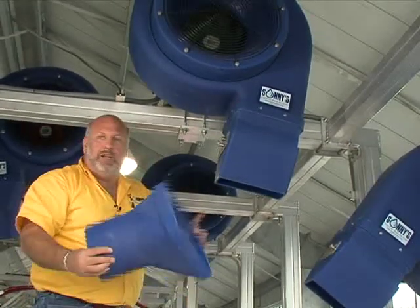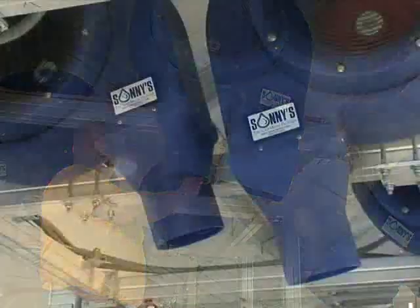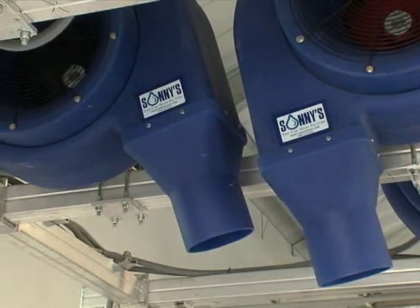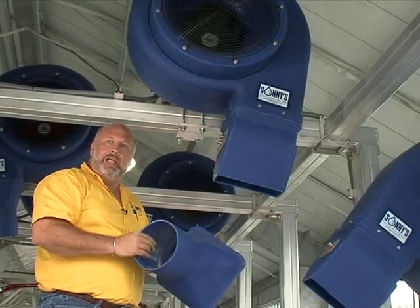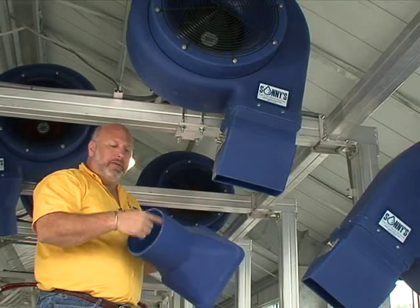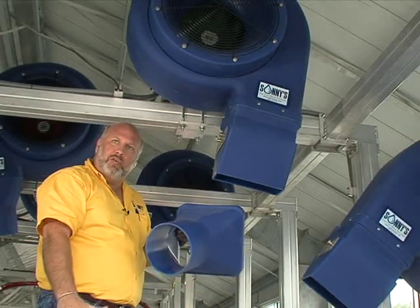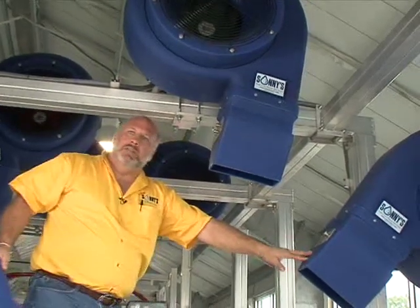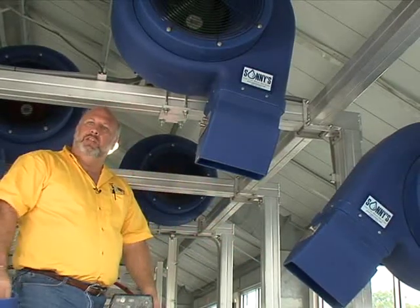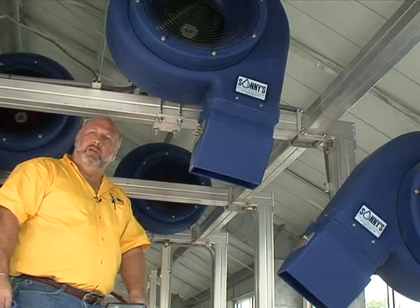If we need a little more pressure or go a little faster, we can convert to our round nozzle, set at 12 degrees — good for stripping at slow speeds but still with the velocity to hit the car properly at high speeds. Like a tube nozzle, the round nozzle keeps airflow straighter and tighter, giving more impact when the vehicle is further away. We normally use the round nozzle up top, then switch to quick-sets, rectangulars, and elephant ears on the sides. You need to mix and match because every car has a different shape.